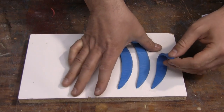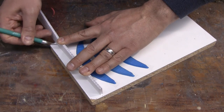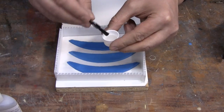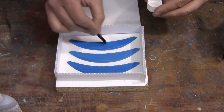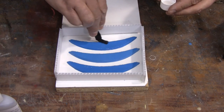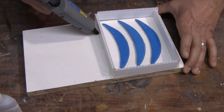We took some double-sided tape to adhere each of the impressions down to a flat base. Next we built a mold box and applied three coats of Alumilite's rubber-to-rubber mold release over the silicone impressions. This step was important because we're also using Plat 55 silicone to make the mold — if we missed this step, the Plat 55 would bond to itself when poured over the impressions.